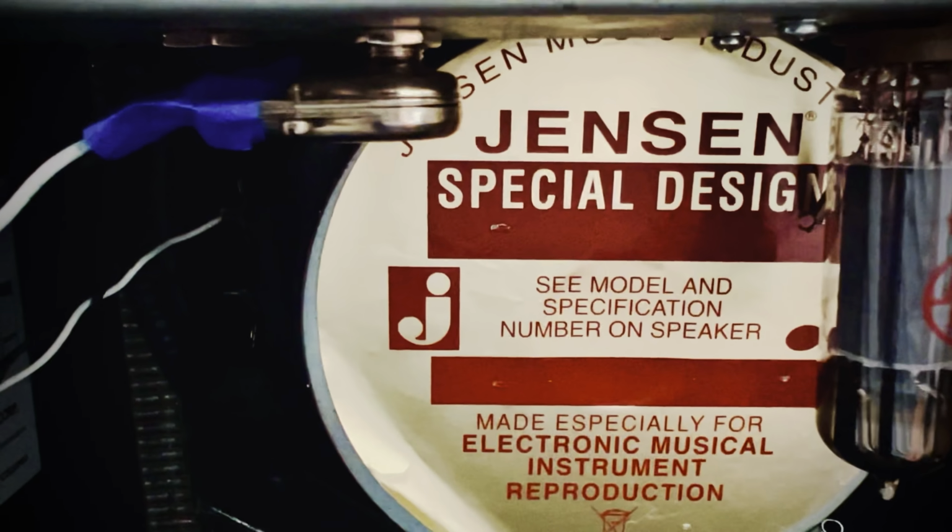So enjoy this amp, man. Enjoy it. You'll know it's time to change these caps out when you start hearing hum in the background and it's not tube related. And, you know, maybe the low end gets a little mushy. You'll know it's time.